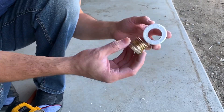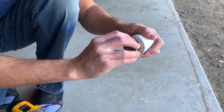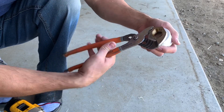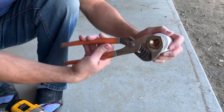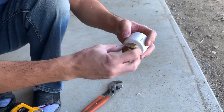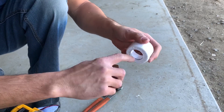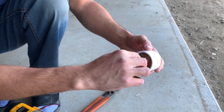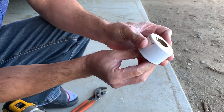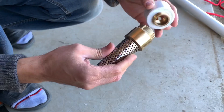So I filed out the hole just a little bit. I still want a snug fit so that the threads will seat into the sides of the hole. This will start going through and as it gets tighter you can just use a wrench and work it back and forth, seating those threads into the plastic going all the way down into the pipe. We're doing this bushing on this side of the cap because it's easier to grab the hex bushing and seat the threads, but ultimately this bushing is going to go inside of the cap. As you can see, we put the bushing inside now and we're turning it so the threads start coming through the top of the cap. Now the foot valve screws onto here.